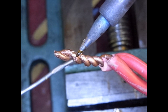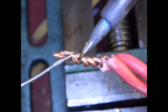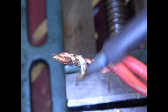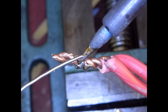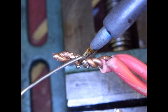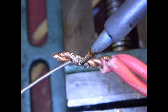This soldering iron is never going to produce enough heat to solder this piece of copper — the wire is just too big, the tip on the soldering iron is too small, and the total heat production of the soldering iron is just too small. Let's give it a try anyway. Wet the tip, get it in contact with the copper. I'm getting solder to stick on the outer surface of the wire, but I'm not going to be able to heat-soak the joint, and I'm not going to be able to get the solder to go all the way down in there.